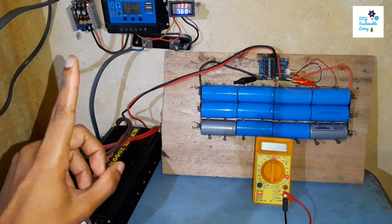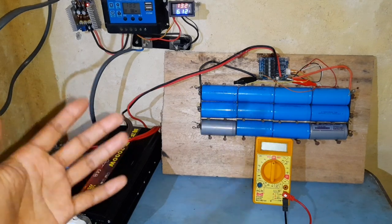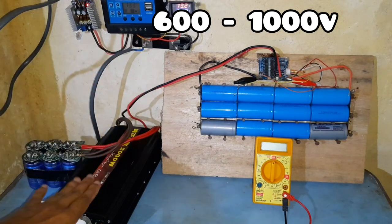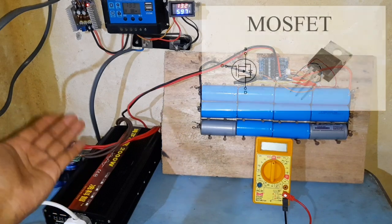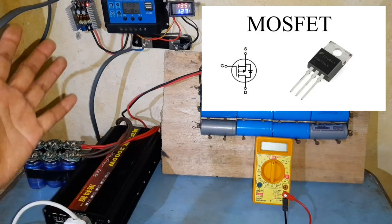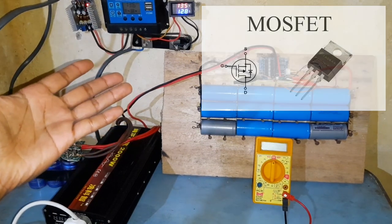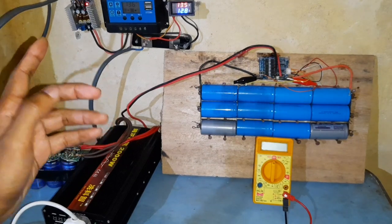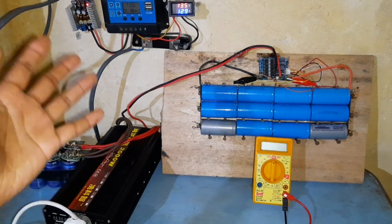So what is the importance of this, and why should we control it? The problem is these voltage spikes can easily reach 600 to 1000 volts. Our inverter has a lot of sensitive electronics, specifically the output MOSFETs, which are very sensitive to high voltage spikes. A voltage spike of around 600 volts for a few milliseconds is enough to fry these MOSFETs. Thus, the mere fact of turning off an appliance has the potential to destroy your inverter and other sensitive electronic appliances that might be running at the same time.